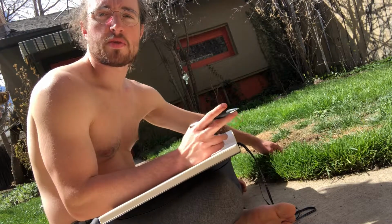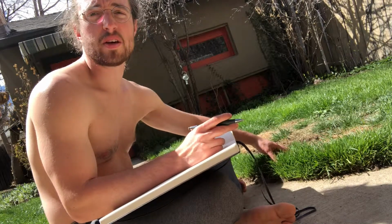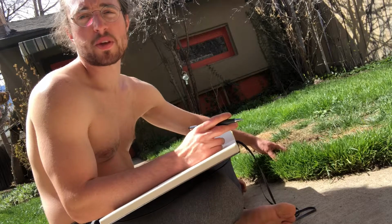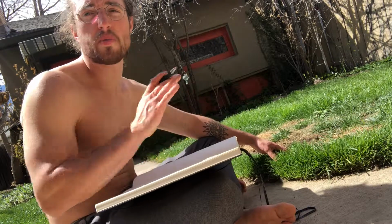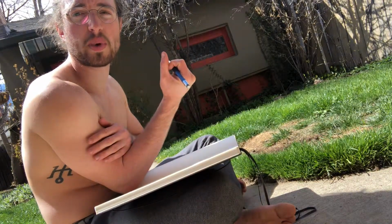In the inner frame and the outer frame, the skin, whatever we're calling it here, there's gonna be a frame for the skin that I'm gonna build that's gonna unbolt from the inner frame, so I can put all the actuators in there and then bolt them together, and then they'll reinforce each other on each side. That's the main reason I'm doing this: if you just put them on the outside, they tend to crush the exoskeleton, especially under the huge loads of my exomuscles. So by surrounding them, they get stronger.